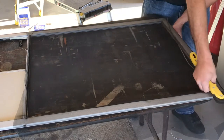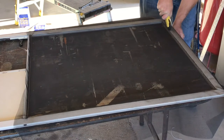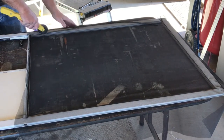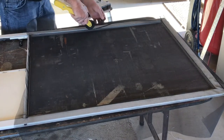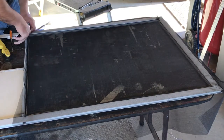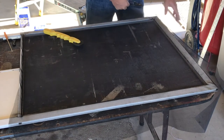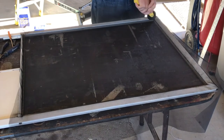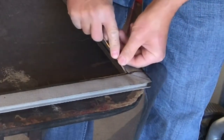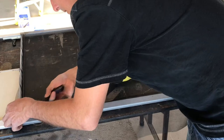This is probably the fourth or fifth screen I've done and for some reason I did struggle with this one just a little bit — it took me a couple tries to get that side where I was happy with how tight it was. Now I'm grabbing my final piece of spline material and working it in the same way, pulling the screen tight and checking it as I go. I'm cutting off any excess spline material sticking out past the groove and then pushing the corners in with the tool one more time. If your spline material is all one piece and you can't get it into the groove around the corners, you could cut it at the corners and push it into the groove with a little screwdriver — that's likely why the spline on my screen was already in three pieces. Be careful using a screwdriver at the corners so you don't rip the screen.